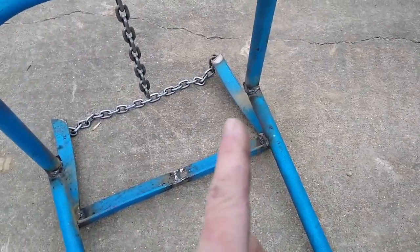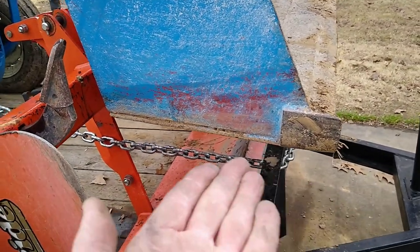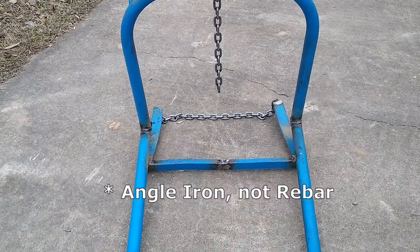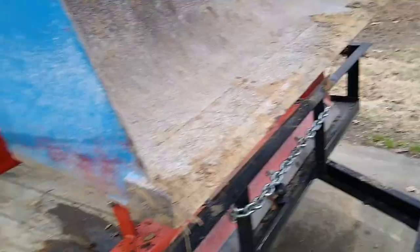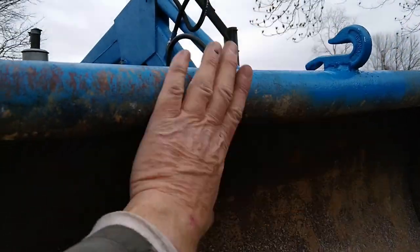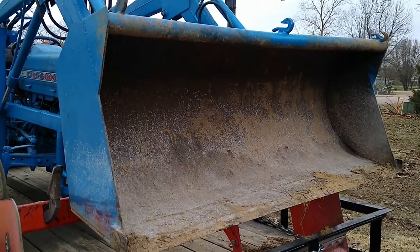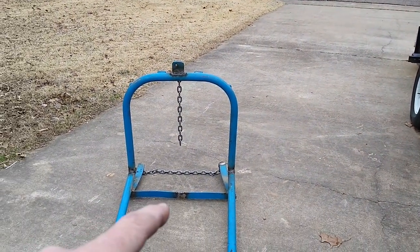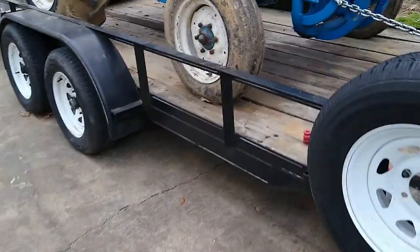After making these runners that go up to the back, they go up under your bucket right here and slide under there like that. That loop of chain is back there on the back, and that piece of rebar butts up against the front end of the bucket right here. The bow on top comes back and butts against this, so it will only go in so far — this stops it on the front edge and this stops it on the top part of the bucket.